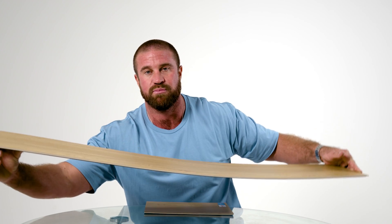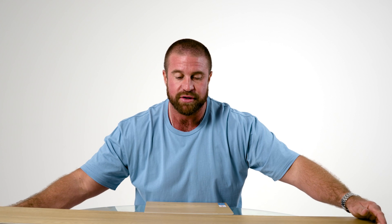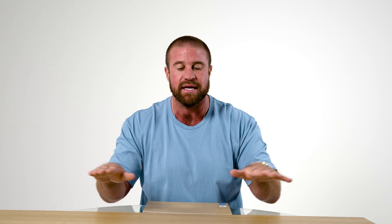The caveat is 99 times out of 100, the subfloor is going to be uneven — this is where this board can go over the wave. And that is the big variation between what we can do versus what the old SPC hybrids can do. If you had engineered timber, a laminate, or an SPC hybrid, they're rigid products. When I say rigid, they must, must, must be laid on perfectly flat subfloors — that eliminates the user friendliness of being able to install the flooring in the first place. Next-gen hybrid — look for flexibility. That is the key to going over uneven subfloors across tiles, concrete, or timber.